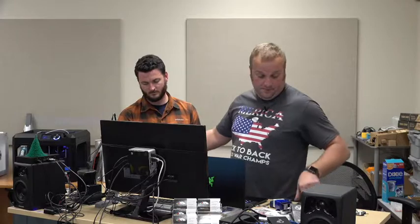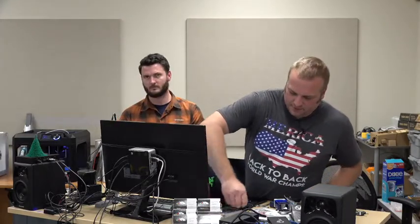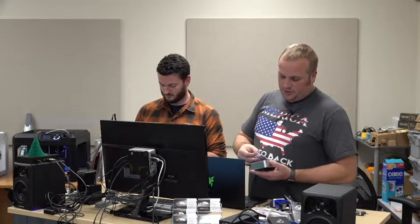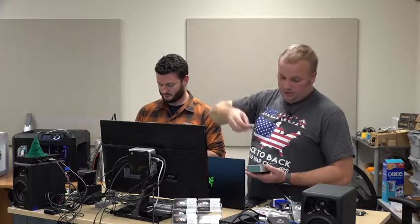I don't know. So do they sell the eBay cloners for that type too? Yeah, so this cloner actually works with it. So here's the kit. I got this kit when I got the cloner. It came with two of the 125 kilohertz cards and two of the 13 megahertz cards, blank. And then it came with the dongles, 13 megahertz dongles, to program.